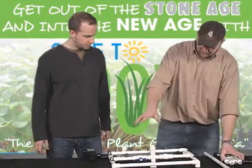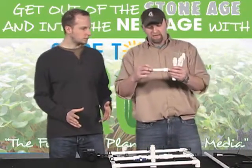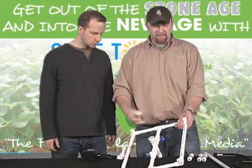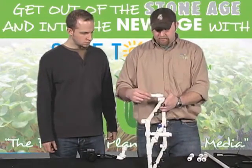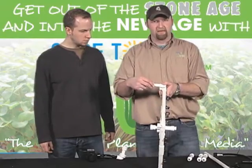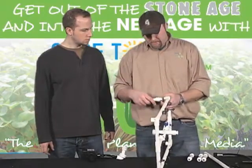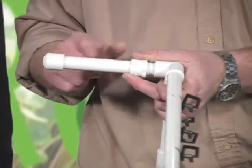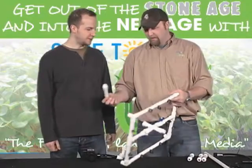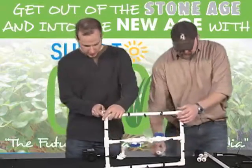What we have here is the manifold with some legs. I've constructed the tops of them to be threaded. The reason I do that is so I can take them off at the end of the cycle, which makes this manifold much easier to clean. I could have just plastic welded these together like the rest of this manifold, but then the legs would be attached and there'd be an opportunity for sediment, algae, and bacteria to accumulate.